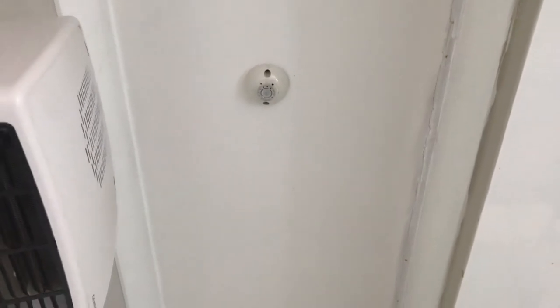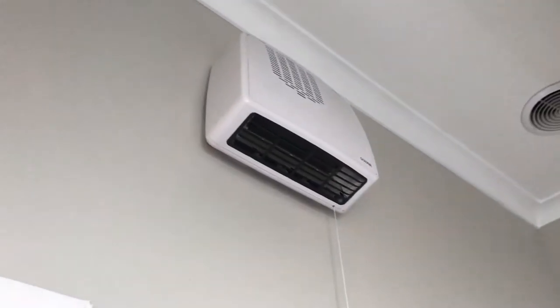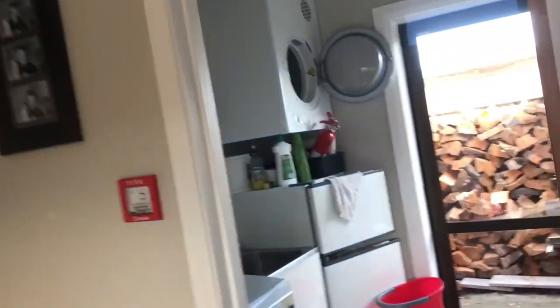In the bathroom, people ask why you'd have a heat detector — you can see the bi-metallic disc on there. Well, bathroom heaters are a really common source of fires. You get a lot of dust build-up if you don't clean them, and next thing you know you get a fire or the thermostat fails, something like that.